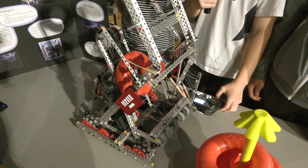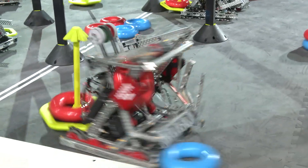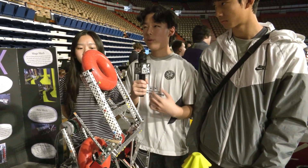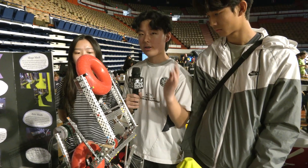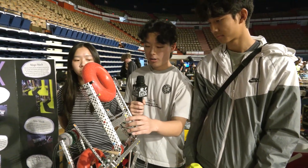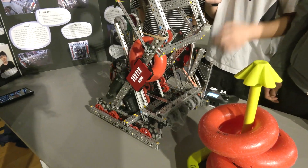I really like the overall build quality here — it's a very efficient robot, nothing overly complex, just done really well. What do you think has attributed to your success as a team at SCORE? We've gotten so much support from people in SoCal — whether we have a problem with coding or building, we always get tips from other teams. For build quality, we just try to go simple and light. We don't make too many sacrifices for weight saving — it's better to have your bot not break than have a really fast but fragile bot. We focus on simple bracing: not over-braced, not under-braced.